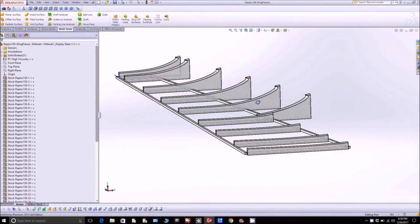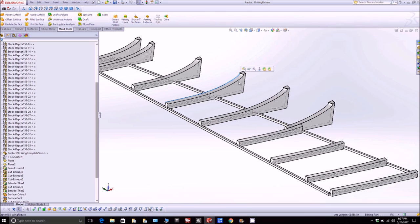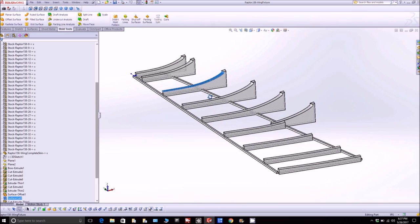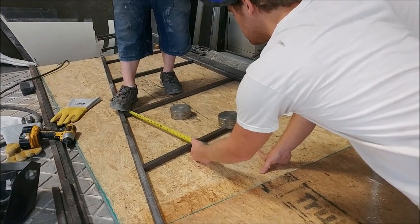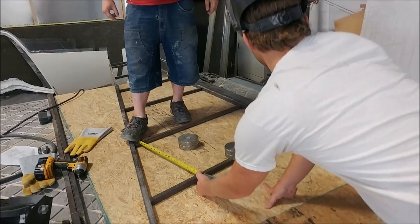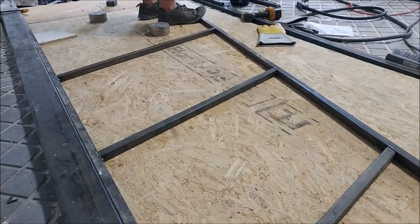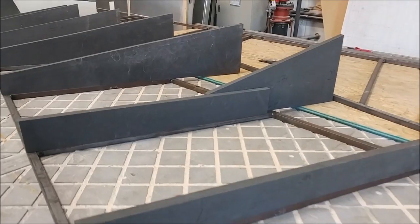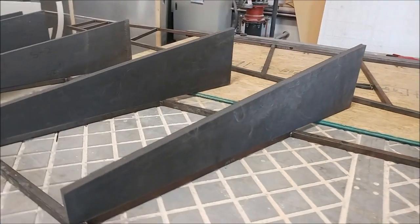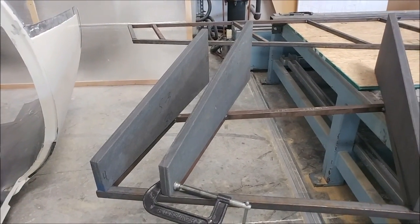You may remember this - it's the wing fixture we're going to use to hold the wing skin in place while all the ribs get done. The machine will be milling those particular edges to create the shape. The guys have been welding up the frame - laying out the steel on a table so it's nice and level, checking measurements, tacking it into place, and now it's all welded up. The black pieces are a special one-inch-thick fiberglass board that's fairly easy to mill; they're resting in place now but will be bolted to the cross braces.